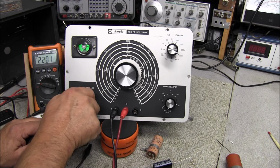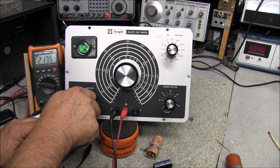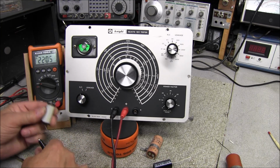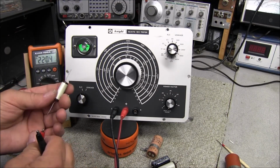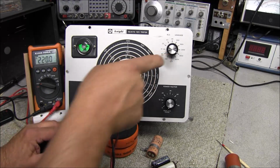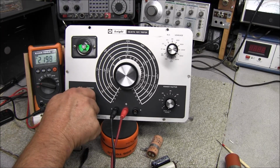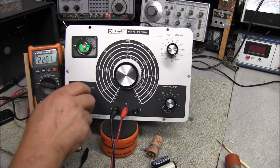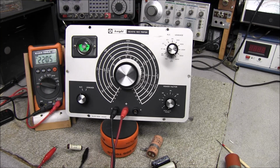It was 350 volts. Look at that, checks good. So 0.5 at 350, at 400, excuse me. Now we don't have a 400 range on here, so I'm checking these at 350. And it checks good. Now it's not going to hurt it to overvolt it for 50 volts. And you can see it still checks good. Opens right up with no problem.